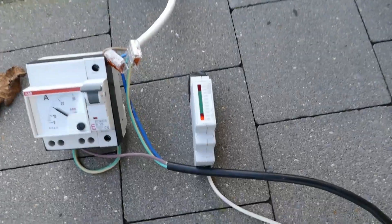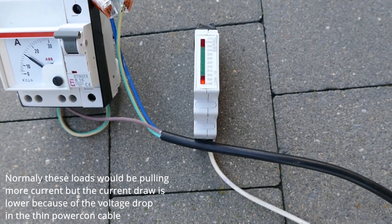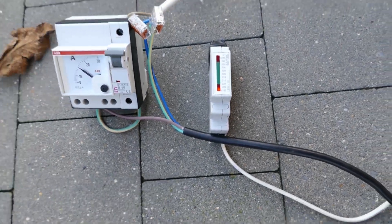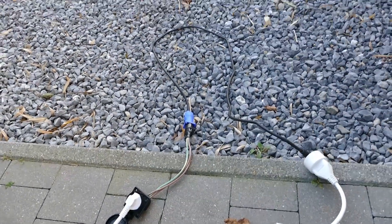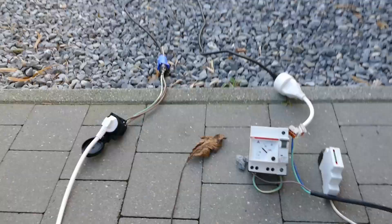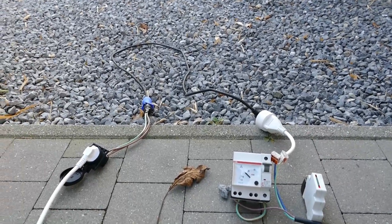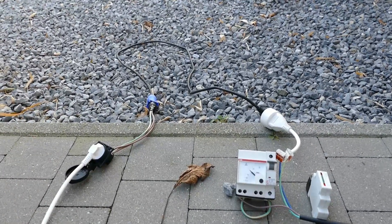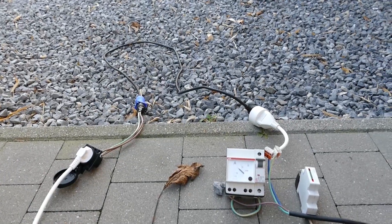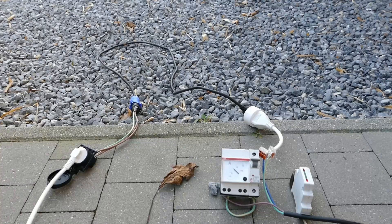It's getting quite hot now. The voltage has dropped even more — it's now showing less than or equal to 195 volts. We are losing quite a bit of voltage in that cable, which means it's heating up quite a lot. But the 16A breaker is still holding on, so we are not doing anything that wouldn't normally be achievable with this cable.